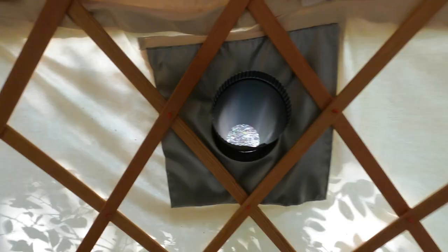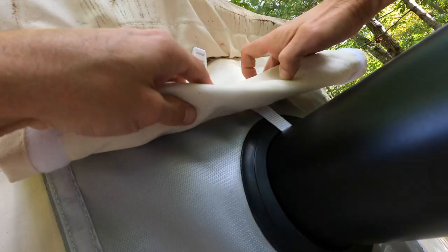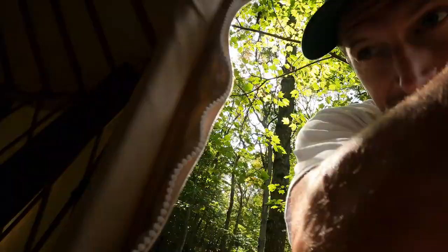I've got the exhaust going out. So I'm going to take the elbow piece we made here, put it back in the hole, and then we're going to attach this piece. This is looking good — cut my hand somehow. Now I've got to get the exterior pipes going and also get some support going for it. This catches the hot ashes — make sure no sparks — spark screen deflector that goes on top.